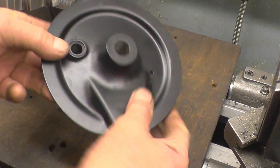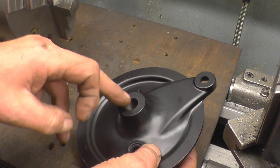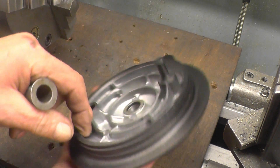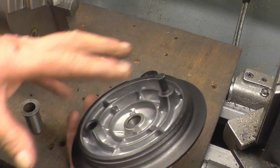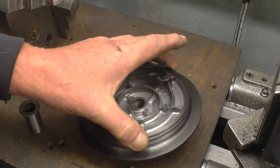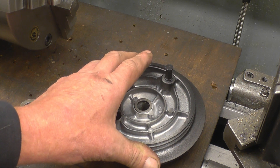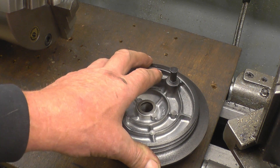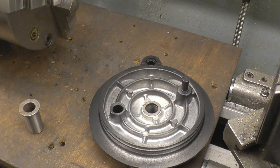This is a motorbike brake back plate. All I've got to do is bore out that so that bush is a nice sliding fit in there. There's a little steel sleeve in there that's going to have to come out as well. Normally I'd mount this in a four-jaw chuck on that face, but what I want to do is try the outside jaws on the three-jaw chuck, just to see how accurate they actually are. I've got it running very accurate on the ordinary jaws, so I'll put the outside jaws in just out of interest.